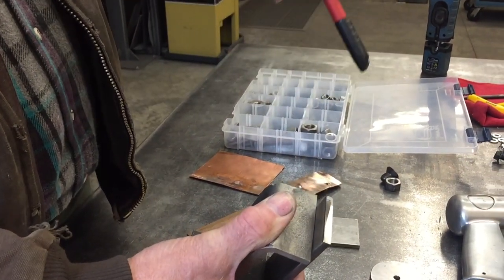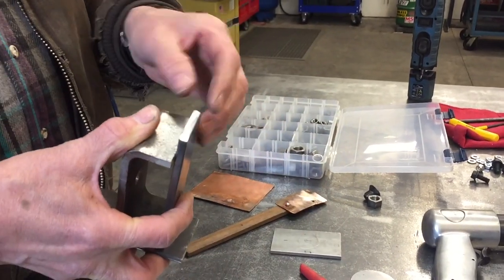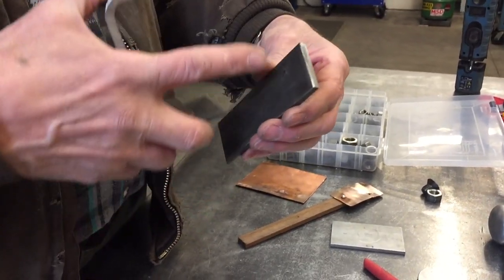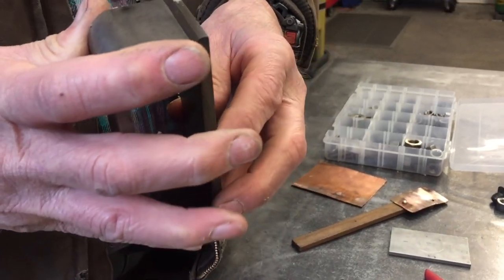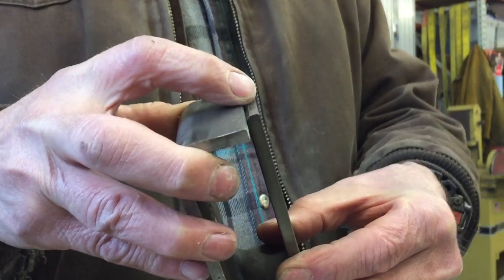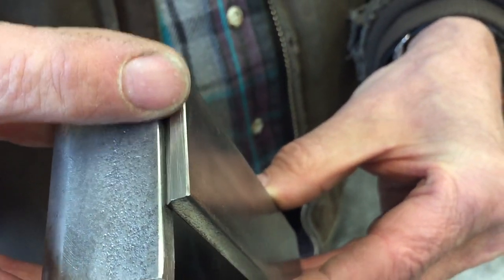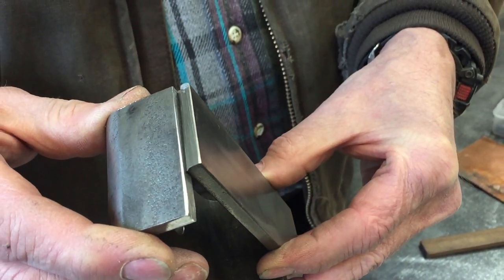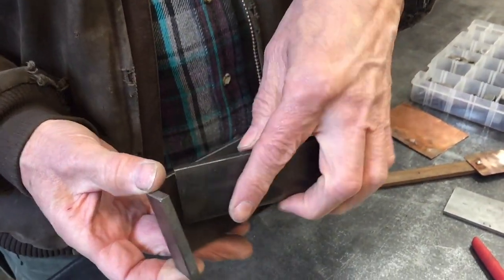Then I'll take a sharpie and mark the top — just a little bit of overhang. I'll use a bandsaw or a grinder or whatever you've got to get it close. When you get it close, you'll bevel the edge, and that way when you put your weld bead in you get good penetration, makes for a nice clean installation. Once you grind it smooth you'll never see the weld, and you can radius this corner a little bit and it'll look like a one-piece tube.